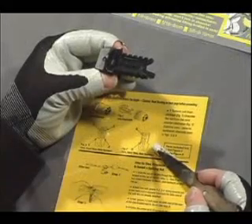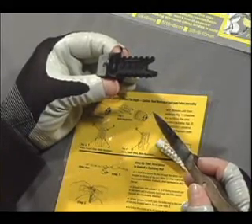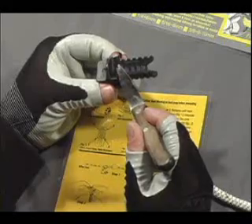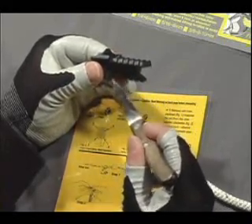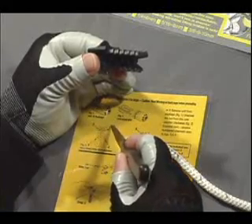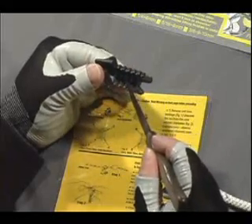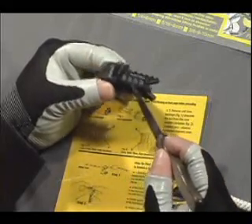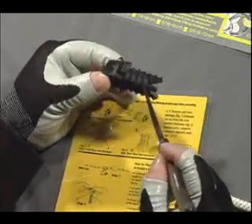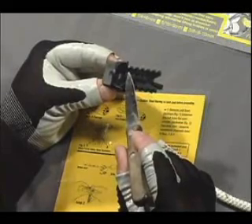Now that we've prepared our end, we need to get a little product familiarization with the splicing nut core. The core is an integral part of the product. On the core you're going to find numbers and arrows to guide you through the steps. Also on the instruction card you'll find those numbers and arrows. It's important that you follow them because the teeth are highly directional — they have a distinct orientation and you must follow them correctly. Read the instructions and follow the numbers.